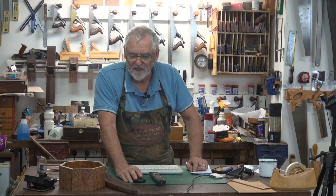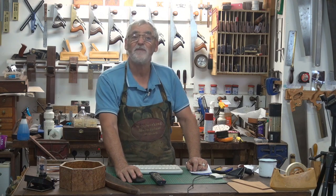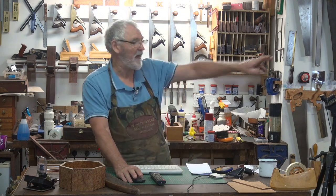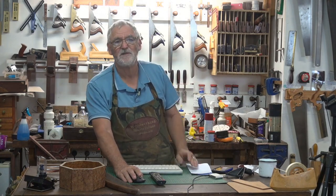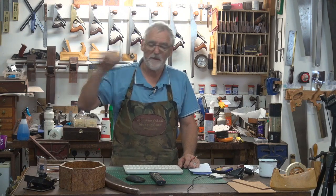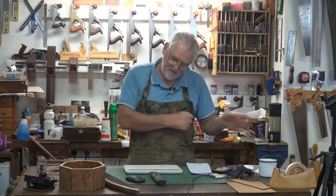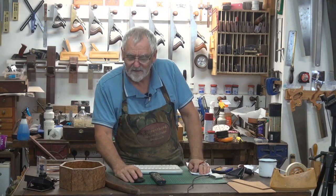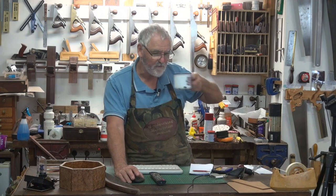Jeff, rumour has it that in tonight's episode, Max Steve Show said he is using a router on the lathe. I've done that before too. The lathe out there, I've got a trimmer set up in a jig that came with the lathe. If you want to do reeding or beading on spindles, the lathe's indexed, and you just click it, run your router up, click it over, run your router up, and you get all these cool little patterns. But there you go. I'm not going to do it today, though. I was going to go up and turn a bowl today, but we might do that tomorrow.